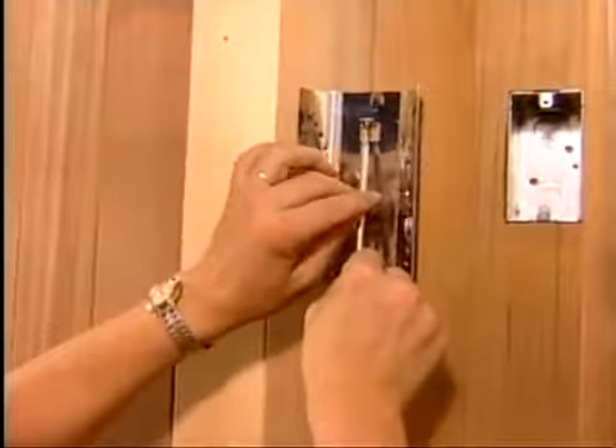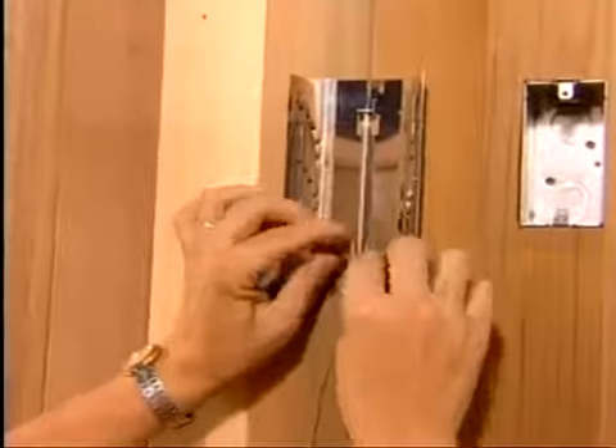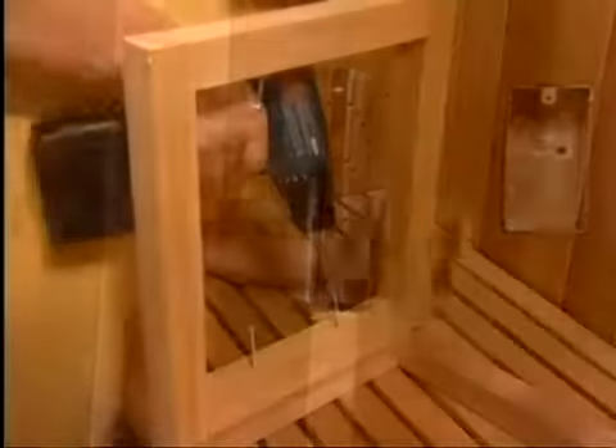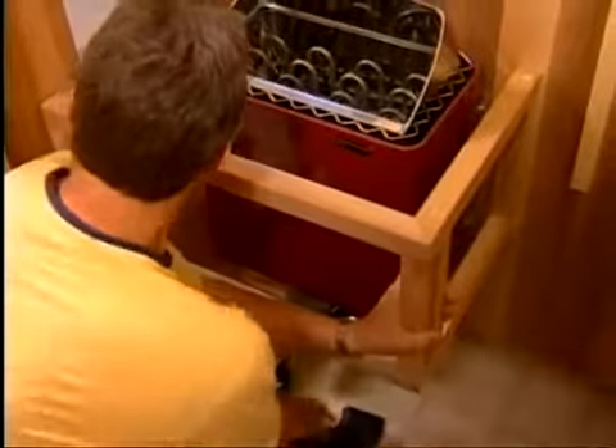The bulb and wire must be completely pulled out. Taking caution not to kink the wire, run it up the wall and cover it with the molding supplied. The sensor wire must not be punctured when nailing the trim piece in place over the wire. The metal bulb guard will hold the capillary bulb in place. With the screws provided, screw the heater guard pieces together and fasten to the wall even with the heater casing.